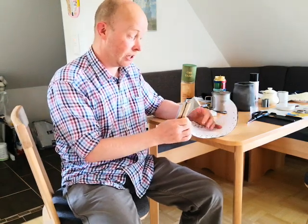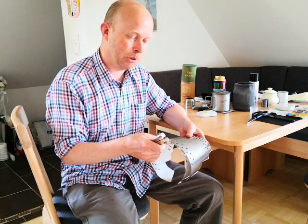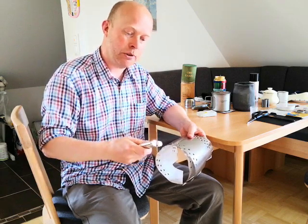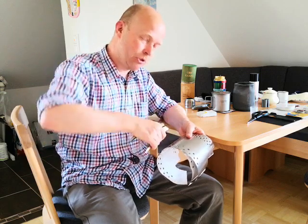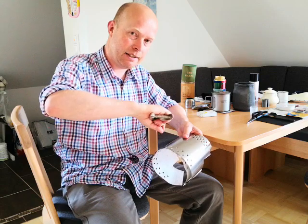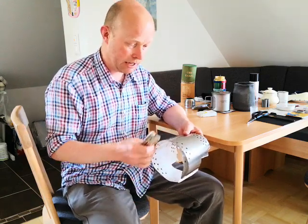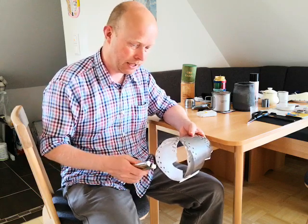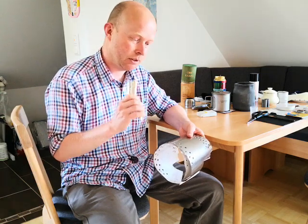I tried it the first time, and I found with an actual dedicated metal punch, it doesn't have a slanted punch that goes through. It's not sharp, it's perfectly flat. And when you punch through the titanium, it has a tendency to kink the titanium, and you get all these kinks around the holes. It looks terrible. Not a very nice effect. I should have had my old comb down here, you could see. So you'd be surprised, but a paper punch will actually do a much neater job.